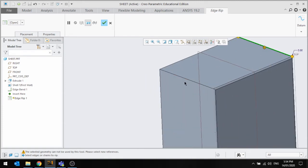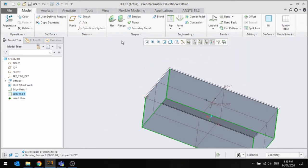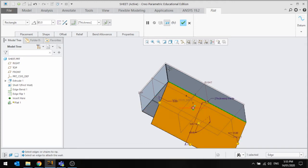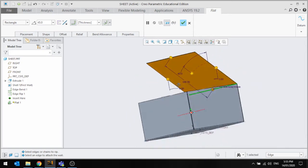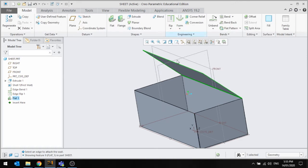I can also add things like flanges off this. There are Flanges and Flats — they're both kind of the same thing. If I go Flat off here, it asks what angle I want, so if it's 45 degrees we've got a bit of a toolbox going on. It also asks how long I want this to be — I'll set that to 300. Press OK.